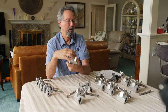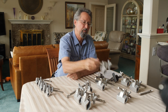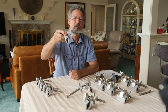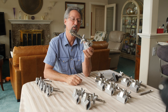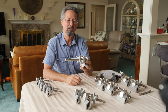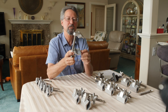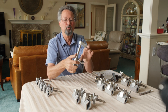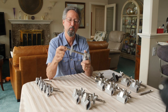As the years went by, people wanted larger clamps, so I made a larger version of the center jaw that opens to three inches, and then a larger version of the end jaw that also opens to three inches. Just a few years ago, I succumbed to demands for one that opens even more — this opens to four inches. In my opinion that's the limit of this design, because when it's open at four inches with a load and you tighten down, there's too much stress on the shaft.